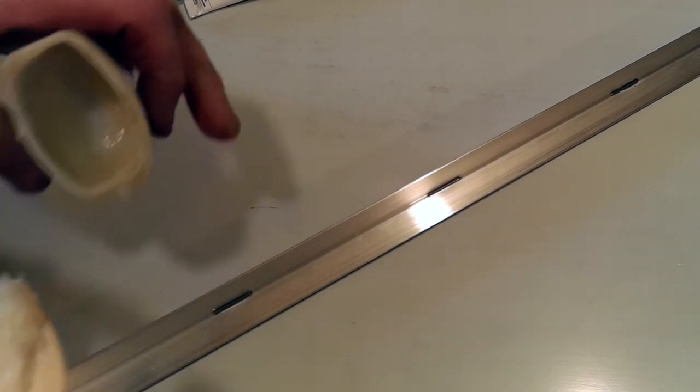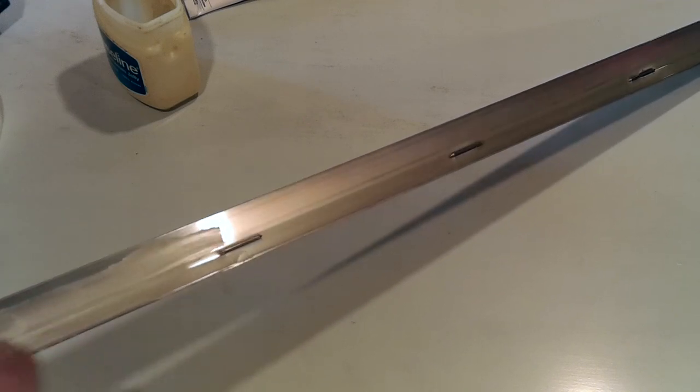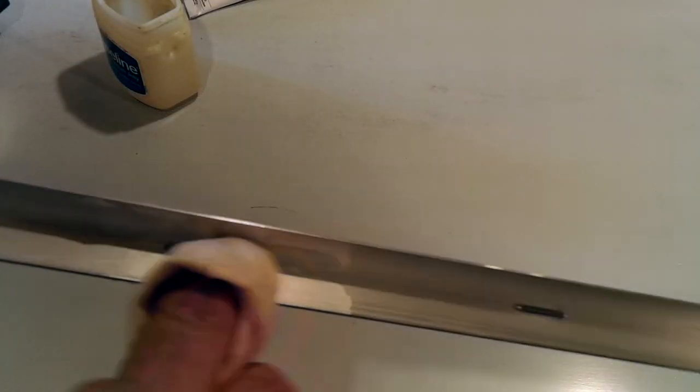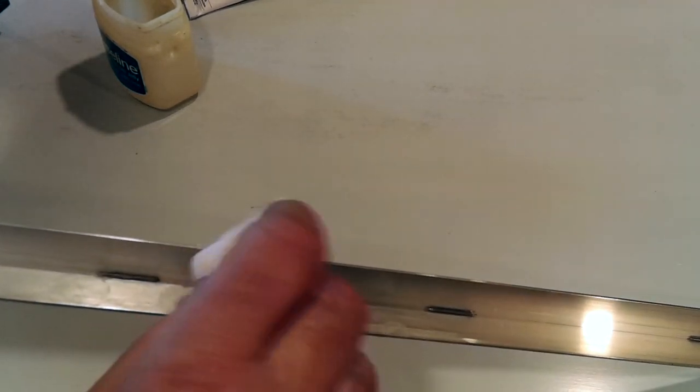To prevent the resin from gluing the aluminium angle onto the bedway, I applied the only releasing agent I could lay my hands on, petroleum jelly. While applying the jelly to the aluminium strip, it also covered the rollers quite well and the ends and edges of the strip at the same time. More by default than design.